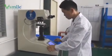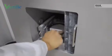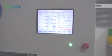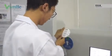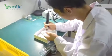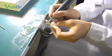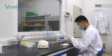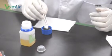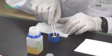For each lot of zirconia blocks, we take a random inspection for strength and also for transparency, and to check the color. We have special equipment to test the strength. Because strength testing takes some time, we also check the coloring process first.